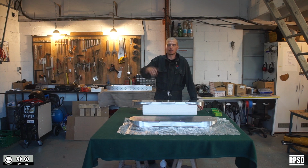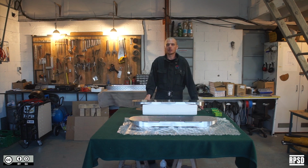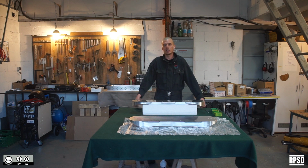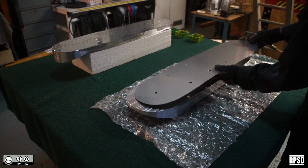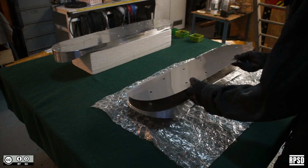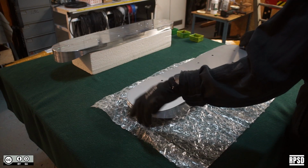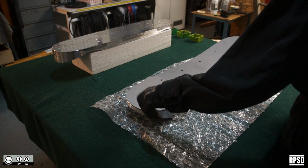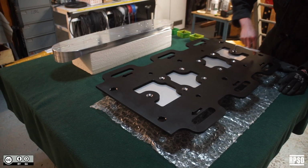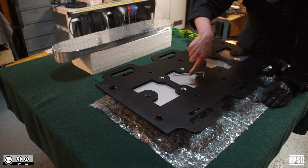Between the top horizontal plate and the top aluminium block, there is a stack of stainless steel washer plates. They're stainless steel to prevent them from rusting because we can't paint them. This is because we need a consistent thickness. Adding or removing the plates allows you to calibrate the thickness of the deck. You may need to change the bolt length if you want to adjust the thickness of the deck, but by default it's 30 mm on the top and 16 mm on the bottom.